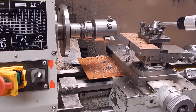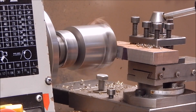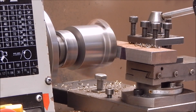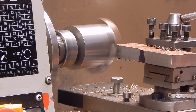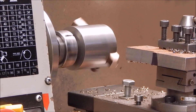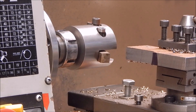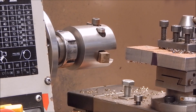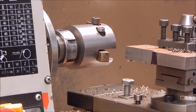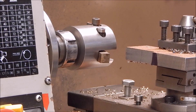You get the drift, just keep at it and you'll get there. I'm cutting this at 0.4mm - 0.5mm is a bit too much. Just do whatever your tool post can stand, no rush. You can see we're about halfway there and it hasn't taken that long. I'm also cutting it dry - I'll just check to see how the cutter's holding up and no problem. No point cutting wet if you can do it dry, you can see your marks a lot easier. If it's flooding the cutter, just put a bit of lube on there.